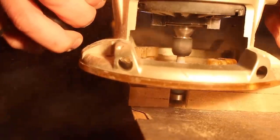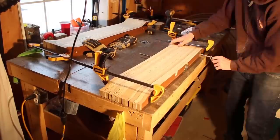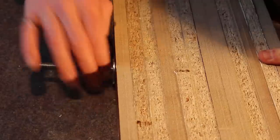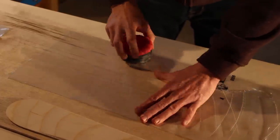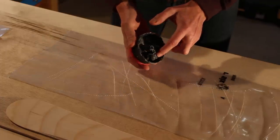Repeat this process as necessary to build the mold to the correct thickness. I then bolted the mold sections together to ensure the mold remained monolithic during the pressing process - movement of the mold sections would create a non-uniform ski profile. For peel ply I used a sheet of poly and just poked holes in it using a wallpaper removal tool.